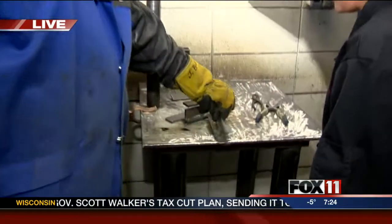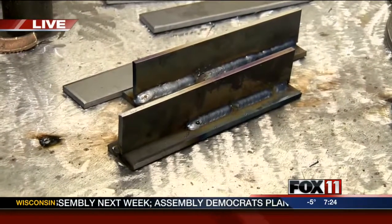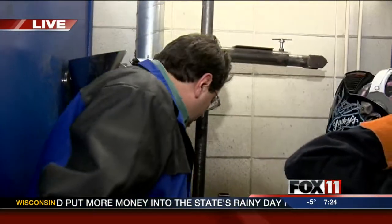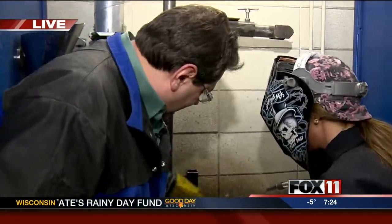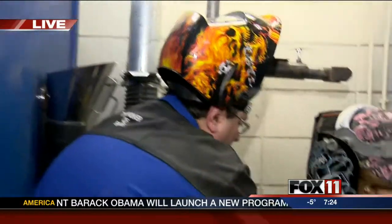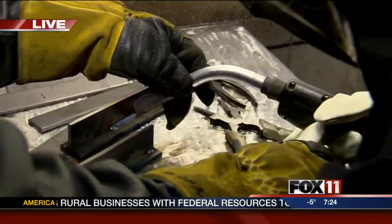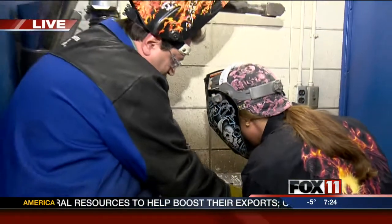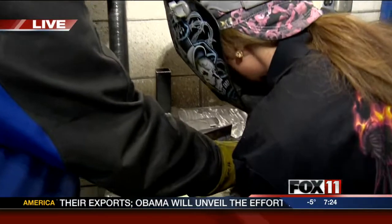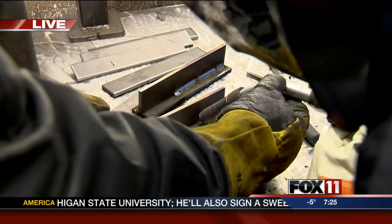Well, this particular welding operation is a T-joint. It is gas metal arc welding — MIG welding. It's a process that's commonly used in most industries around the area. So I practiced this on the virtual welder and now I'm ready to do the real thing because it can be intimidating. So what would you like me to do right now? Well, what we're gonna do is there's a fresh T-joint — it's quarter inch steel. We're gonna clip off a little bit of wire here, and what's important is to get some stability, so holding the gun is important and the direction we're gonna point it is important. We're gonna look at the wire, point it in the direction of the joint, pull the trigger, and then just move at a nice modest rate. You're gonna watch where the wire goes into the joint.